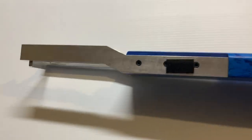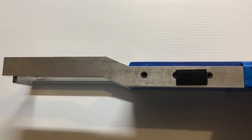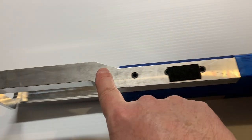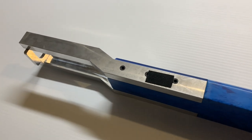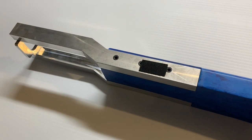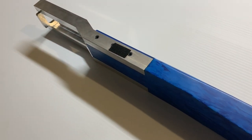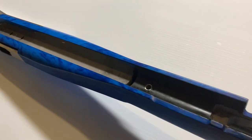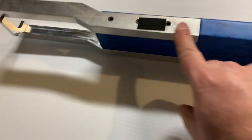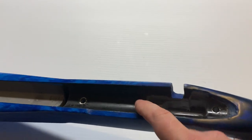The Z-rail up here — I'm going to put my action in this in a minute and show you how it rides on a rest. The way the Z-rail works, you can see it really lowers the center of gravity. This is where it's going to ride on the bag, and it brings the whole stock down below that, which makes for a very interesting feel when shooting. Each one of these is handmade; I've been told one guy spends at least a full day hand shaping and fitting the Z-rails. They specifically ask for barrel dimensions, the action — short action, long action, all of those things.